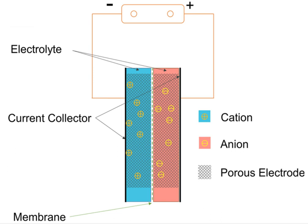In 1999 he coined the term supercapacitor to explain the increased capacitance by surface redox reactions with Faradaic charge transfer between electrodes and ions. His supercapacitor stored electrical charge partially in the Helmholtz double layer and partially as a result of Faradaic reactions with pseudocapacitance, charge transfer of electrons and protons between electrode and electrolyte. The working mechanisms of pseudocapacitors are redox reactions, intercalation and electrosorption (adsorption onto a surface). With his research, Conway greatly expanded the knowledge of electrochemical capacitors.